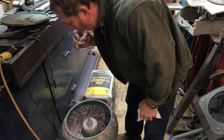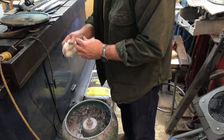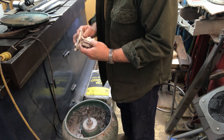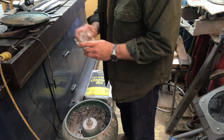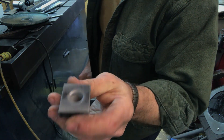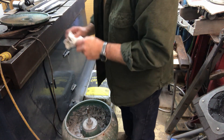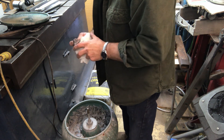Well, it's only been a couple of hours that we've had this tumbling, but I thought we'd take a look at it and see what they look like anyway. I'll tumble these a little bit longer — I've still got quite a bit of scale on them, but the edges are at least not sharp. We'll tumble these for about three or four hours tomorrow and finish cleaning the mill scale off the ends and things like that on the top and bottom. Let's grab a couple more out of here just to see how consistent they are. Yeah, they'll take a fair amount of tumbling still.